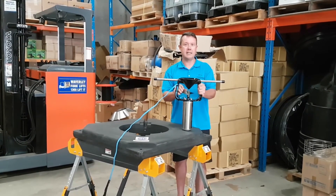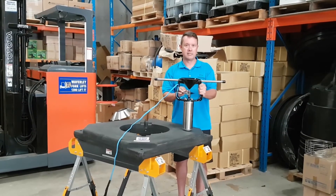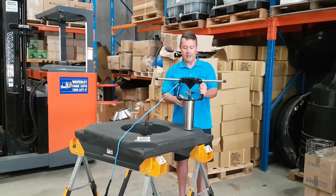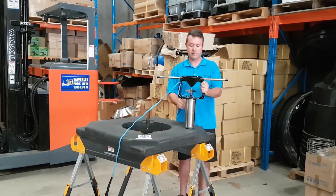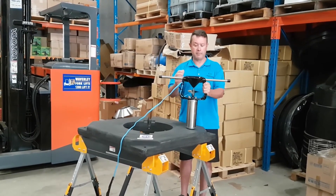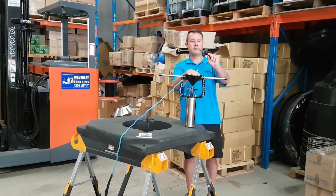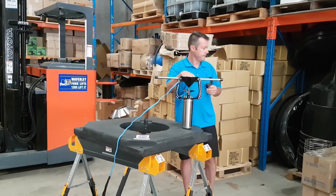When a propeller's spinning around like crazy, water is corrosive so it actually wears a propeller out. These ones are a polycarbonate blend. If you see any nicks or uneven wear marks on the prop, you just replace it. Because if the prop spins unevenly, it'll end up causing damage to the drive shaft in the motor itself. It's just a case of taking off a bolt here, sliding out the tube, popping the prop off, putting a new one in. You can see there's a replacement prop — relatively inexpensive — put it on and off you go, good as new again.